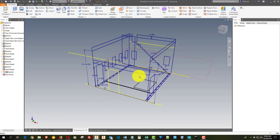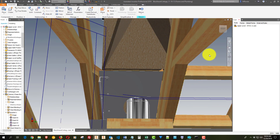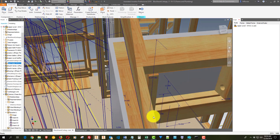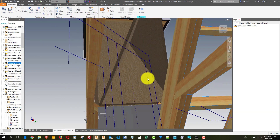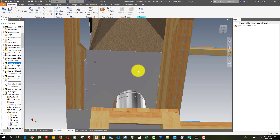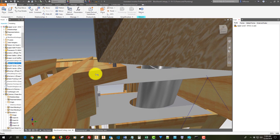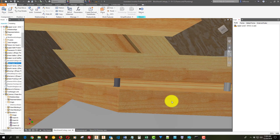There's the addition there. This is a doubled truss right here because there's a stairway right here. So this stone-covered chimney sits directly on this double joist from the truss, but the other side could not sit on the next one. So what I did was build it out and put in a three-eighths inch L-bracket, bolted right up into the unit itself.